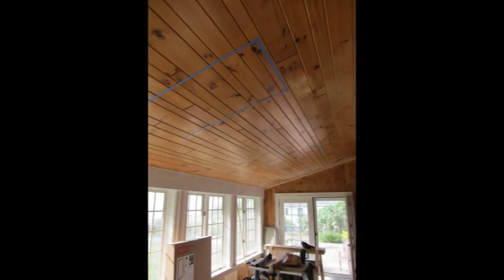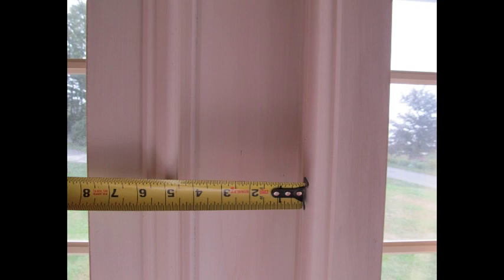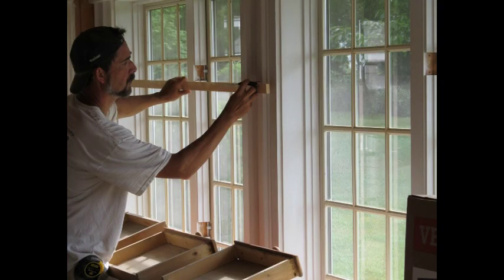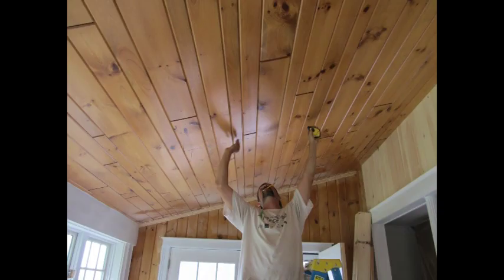Here we are going to locate three skylights into a ceiling. I'm locating the skylight placement roughly with blue painters tape, adjusting the location a couple of times to achieve perfect symmetry. The three skylights are to be centered between four window units. I take the center measurement — two and five sixteenths — and transfer it to a marking stick where I can locate the exact center line for all three units. I also know that the windows are symmetrically placed because I relocated them last week.